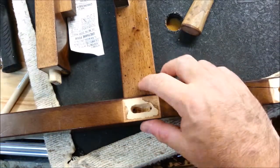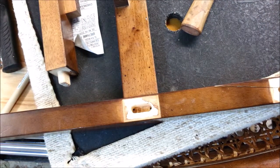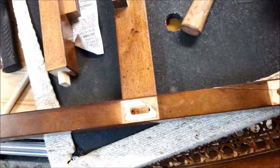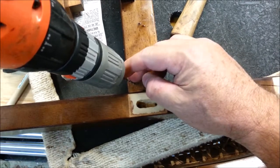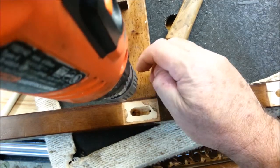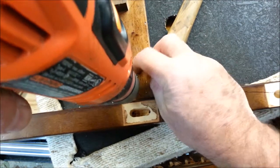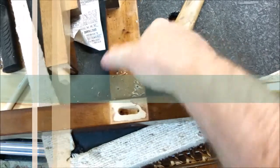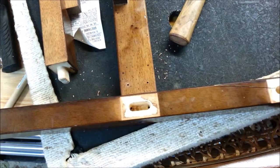This is the inside — it can't be seen. This is the spread of the dowel pins. They're a little bit loose, but not loose enough for me to get this apart, so I'm going to drill these two. Then I'll use a syringe or possibly some thin glue to get glue on those dowel pins. I made sure I didn't drill through — good, I didn't. If I can't get it apart, that doesn't mean I can't get glue in there.